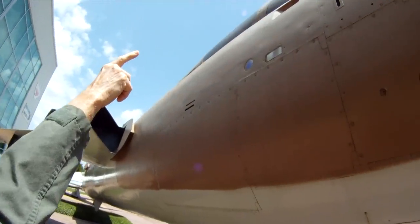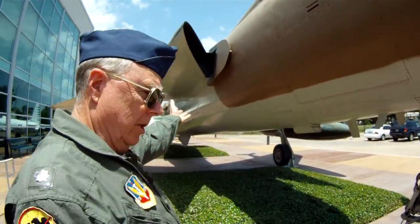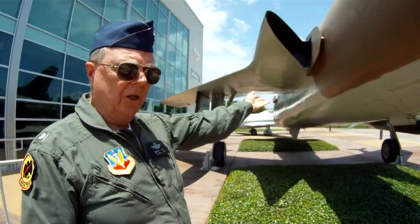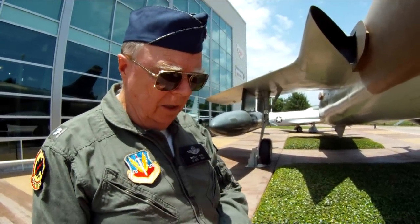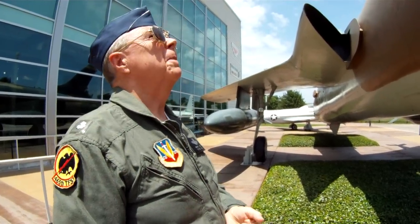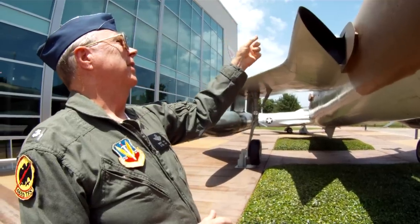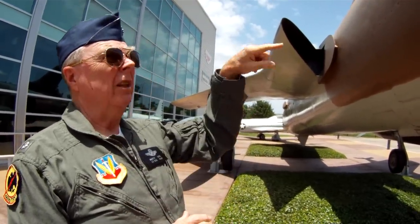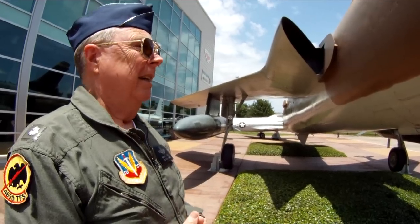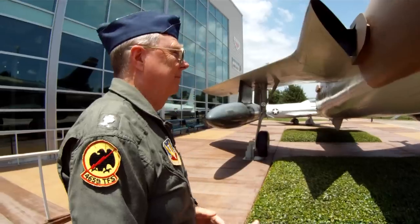This slide up here is the exhaust for the ATM — Air Turbine Motor. They used compressor air from the engine, led the air up here, and it powered the AC generator and the utility hydraulic system. They had a sensor on there just in case you got an air leak, because it was 13th-stage bleed — it was very hot and could cause a fire. There's a warning light in the cockpit that tells you if there's an air leak, a bullet hole through it, or some other bad thing happened.